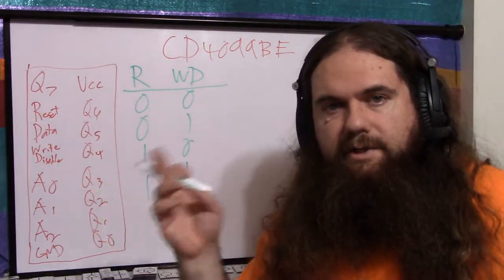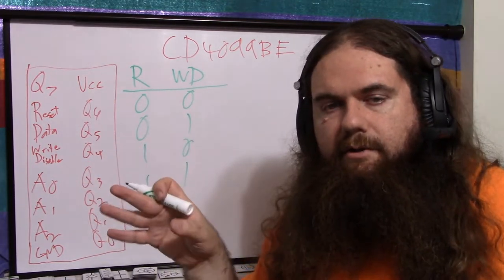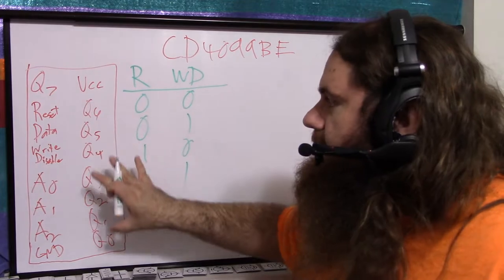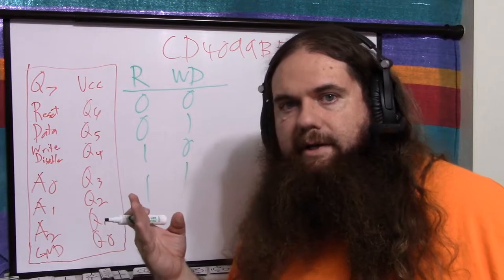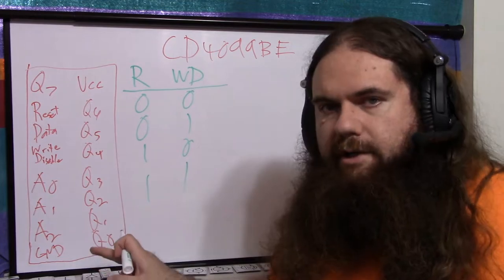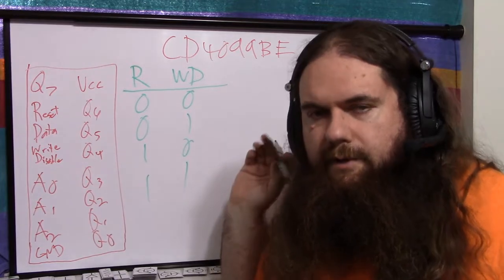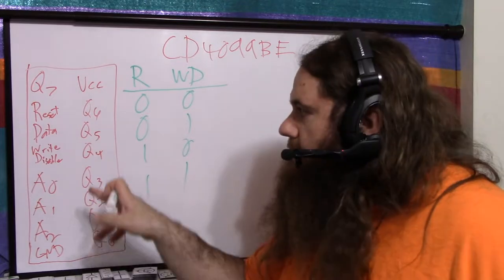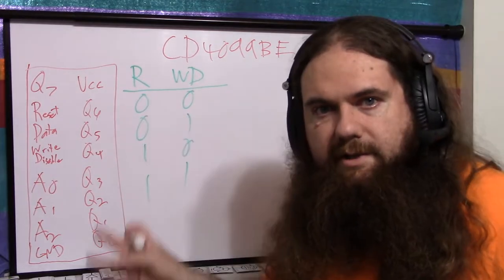Like a shift register, if you want to change what's in a serial shift register, you have to shift in 8 bits, and all the bits are changing the whole time because they're walking down the thing. But you can change one bit at a time here, which is nice because you can not disturb the other 7 bits. So if whatever's on the other side doesn't want spurious signals, it doesn't want to be switching all the time, then you can change one bit at a time and it'll be nice. You can use a shift register if it doesn't care. Like if you shift into a shift register and then tell the next thing, okay, now read it, then it doesn't matter. But this is nice if you don't want to be changing bits you're not trying to change in the process of changing some other bit.